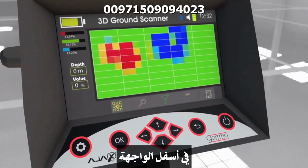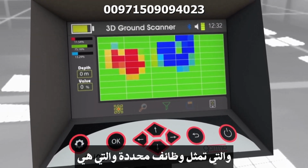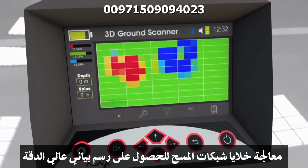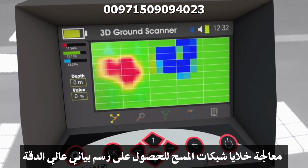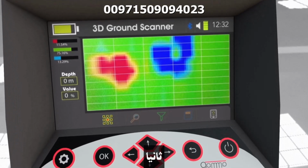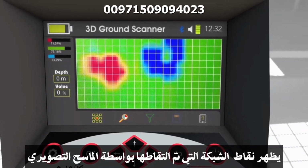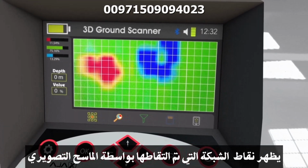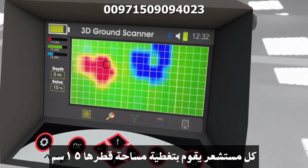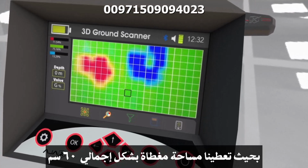On the bottom of the interface, there are 5 icons representing specific functions, which are: A. Scan processing icon calculates the scan grid to get a high-resolution graph for the scan once it is conducted. B. Magnifying glass icon shows an overlay grid representing the capture points by the imaging scanner, which contains 4 accurate sensors, each covering a 15 centimeters radius area, giving a 60 centimeters overall covered area.